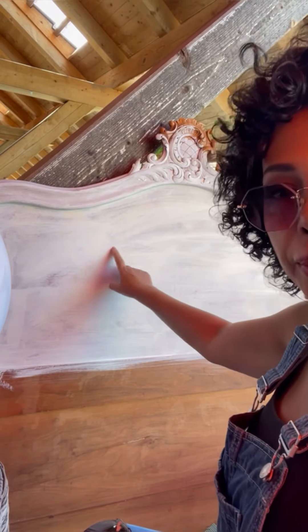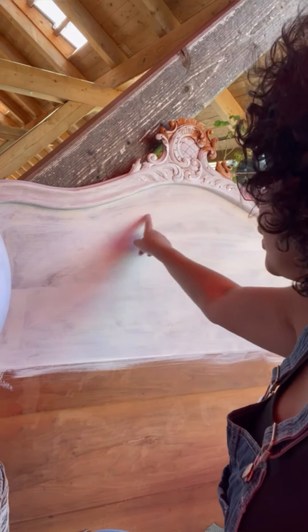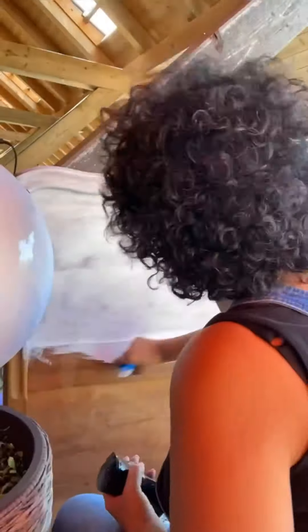As you can see, I just started to paint and it's already becoming yellow, which means the wood is bleeding. I'll probably need to make two or maybe three coats — we'll see. Always have a bottle of water nearby because this material is sticky, and you can make it lighter to work with the brush. But not too much water, because we don't want to destroy the effectiveness of this material.